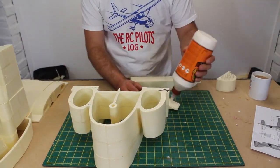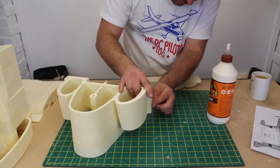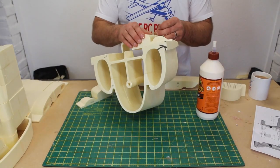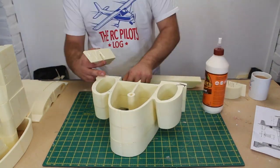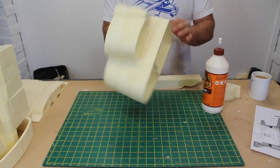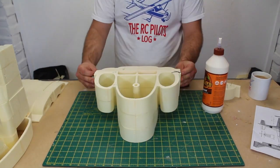Before I can start work on the wing structure I need to complete the fuselage centre, starting with the base sections I'd kept separate for a one-piece wing plan. A few of the sections had some damage, most of which was on the internal face so won't be an issue, but there's one or two sections with damage on the wing joint so they'll need to be repaired.